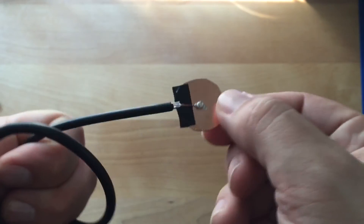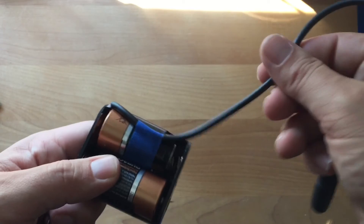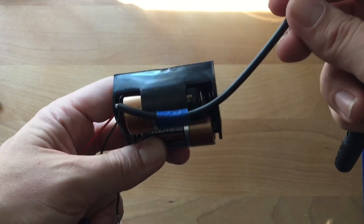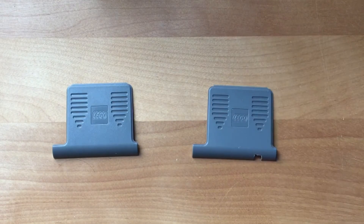Now here's where the weak spot comes in. This joint is not strong — the material isn't going to hold up well against being tugged on. A good idea is to add some strain relief. Maybe you attach the cord to one of the batteries with tape or a zip tie, so that if it does get pulled, you aren't going to damage the interrupter. If this is going to permanently stay inside a project, maybe you can find a place to hot glue the wire down, but make sure you leave room to remove the batteries. If the project has an enclosed battery box, you may have to cut out a notch to let the wires out.